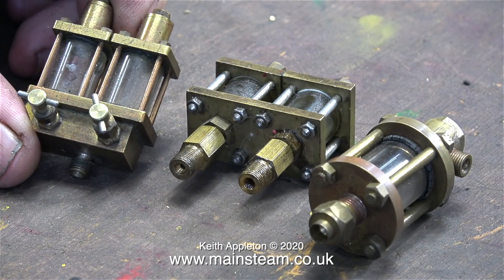These are a type of displacement lubricator called hydrostatic lubricators. The glass part is normally filled with something like glycerin and then you can see the drops of oil going from the bottom of the lubricator to the top, which shows the quantity of oil that's been admitted to the cylinder. These are not actually lubricators — they're just the sight glass part of a hydrostatic lubricator. Normally the displacement tank, also known as the oil tank, is sited somewhere else on the engine.